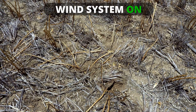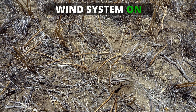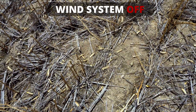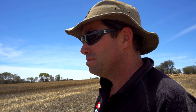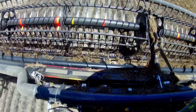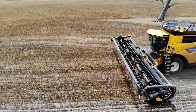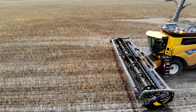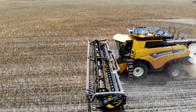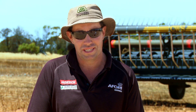That's a pretty good depiction of what it's like actually. I think there's a definite yield increase just by seeing the amount of pods that get left behind without using the CWS. You can see the difference — about 250 kilos per hectare. Pod loss over the knife is definitely less. It was probably that direct drive system that made me choose the CWS, and yes, definitely the CWS would pay for itself.